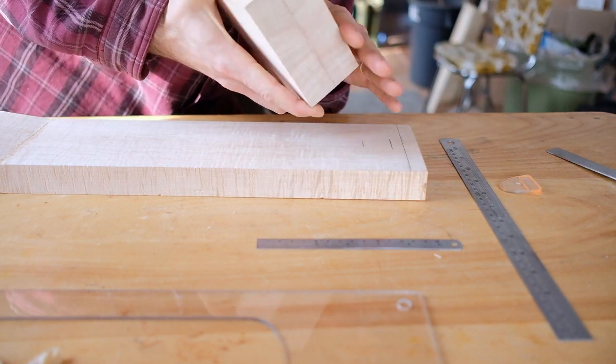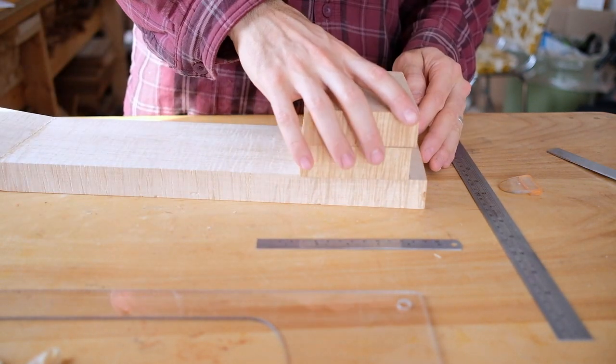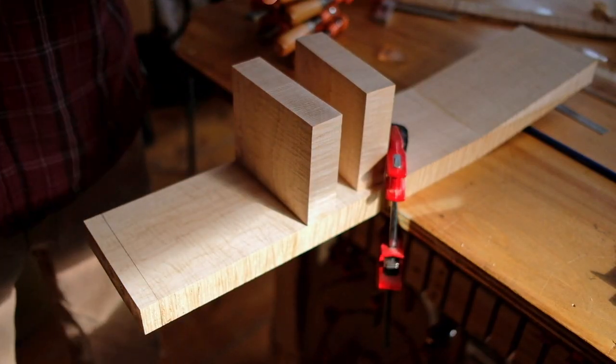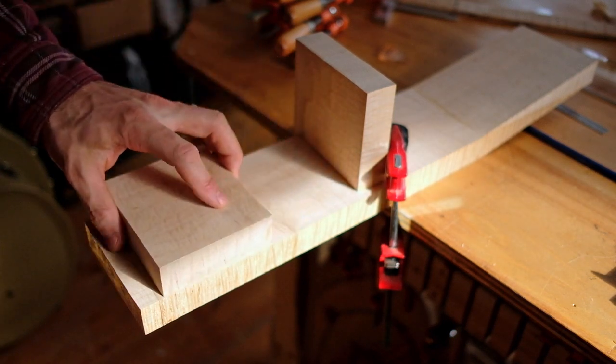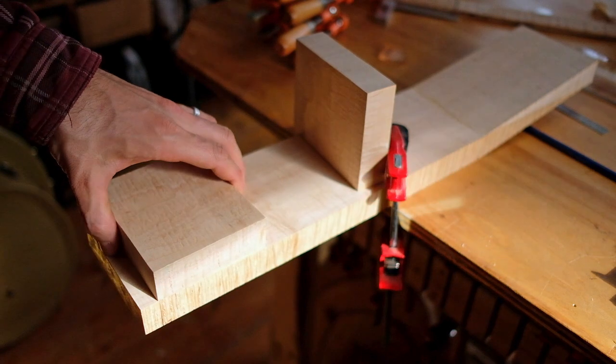It can be helpful to line up grain orientation on the heel blocks. Here's a good thing to notice — I want to work around any defects. If I put that to the top, my heel's only going to be up to here, so I can cut that off — no big deal. Flattening these, I'm just going to kiss them on the belt sander. Then I have a nice surface to glue together. These are now sanded; I just have to add the glue and clamp it up — just making sure it doesn't slide everywhere when I start clamping.